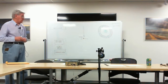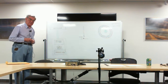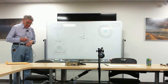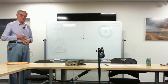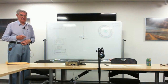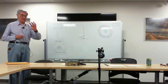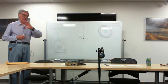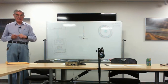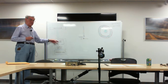With any kind of antenna, including this, actually the best place to put your matching network is right up here at the antenna itself. But that causes a big problem, because you can only get a perfect match at one frequency. You start shifting around frequencies, or worse still, shift to a different amateur band, you need to make a radical change in the adjustment of this.